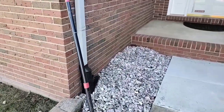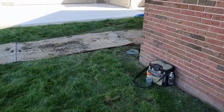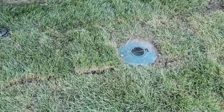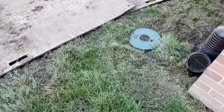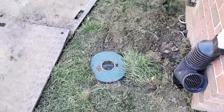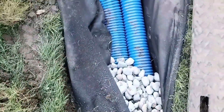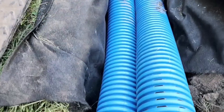Keep in mind that your roof is a non-permeable surface, meaning you're not going to lose any of that water over that square footage. All the water that falls on your roof is going to end up in the lawn. So now you have a high concentration of water in your green belt area, which is already taking in water from the rain — meaning you're typically taking in twice as much water for a given square footage of green belt in the suburbs.